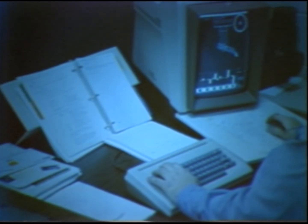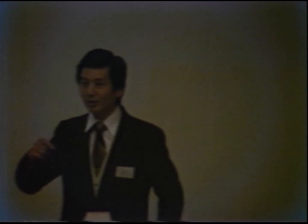What kind of encoder do you use on this? That's an optical shaft encoder, but it has a very high precision. Is it absolute or incremental? We use the incremental type encoders for joint 1, joint 3, joint 5, and 6. And for joint 2 and joint 4, we use the absolute type encoders because we do not have to initialize the counter encoders. Joints 2 and 4 move drastically, so it's very dangerous when you start up.